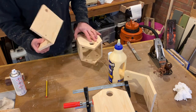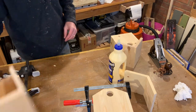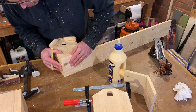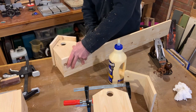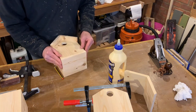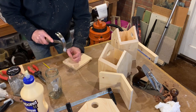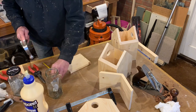Already that's glued. Now I'm making the bottoms — this is really straightforward. Just line it up with the bottom of the birdhouse, mark it with a pencil, take it over to the mitre saw, cut that section out, come back and glue it on. I tend to put a couple of nails in the bottom first of all, and then I'll turn it over and glue it, but I start the nails off first.